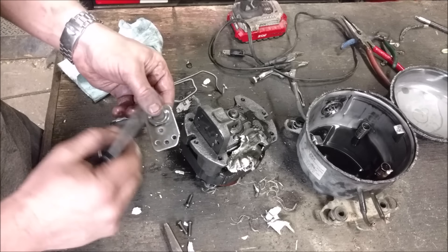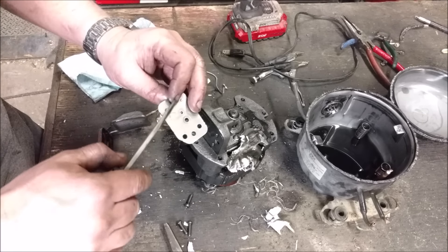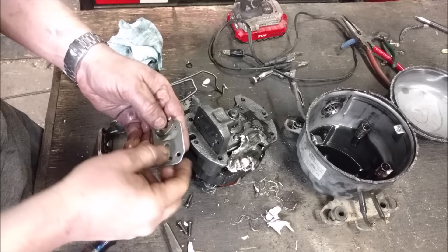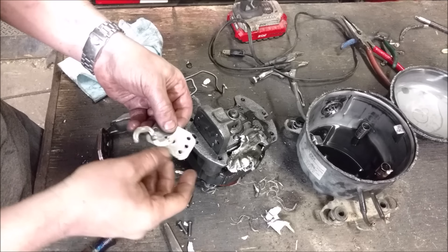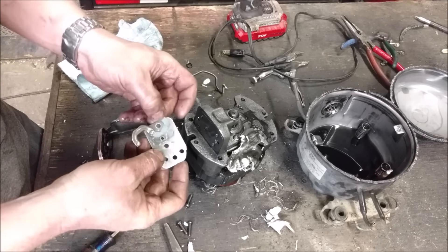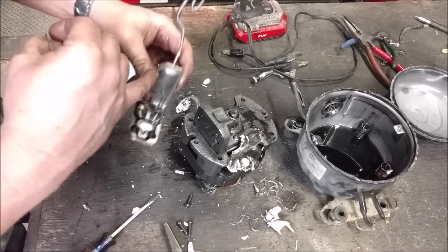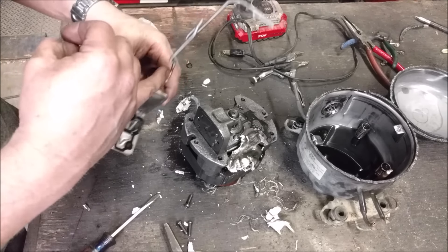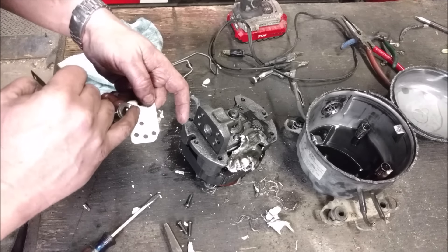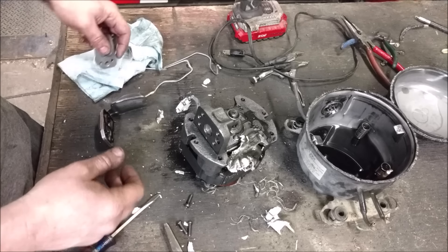I got the other piece off and here's our other valve — it's riveted on so I drilled out the rivets to show you. This big metal piece is just a limiter so it doesn't let it flap up too high. And you've got this piece of stainless steel that just allows pressure to come in but not go back out. Higher pressure closes it off, so it just pressurizes down that hose. This is all welded together and just a hollow chamber. So we've got our intake valve right here and our exhaust valve right here.